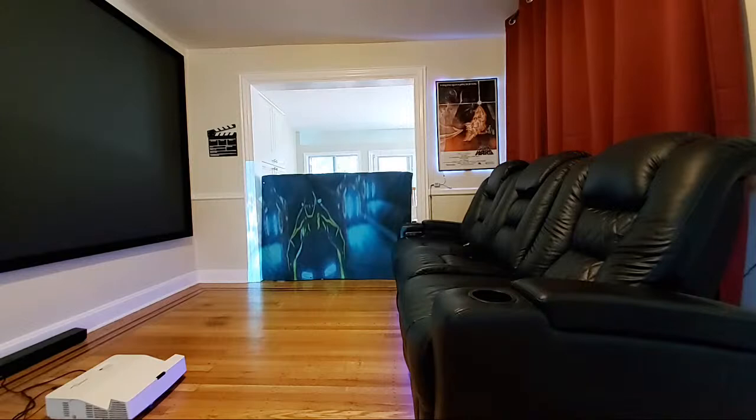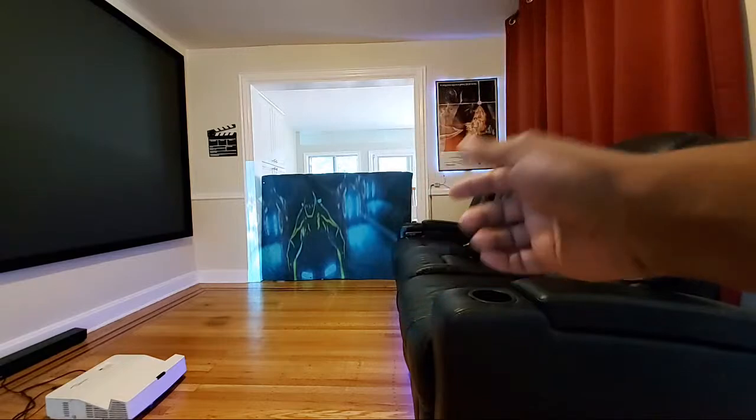You know what I mean? They might only have 1,000 lumens by the time that projector reaches its destination, because the light in the environment is going to rip it up. So that screen has to be able to generate high enough gain, contrast, color, the whole nine yards, to produce an image from what little lumens make it to the screen. It's going to have to generate enough gain for you to see the image coming back at you.